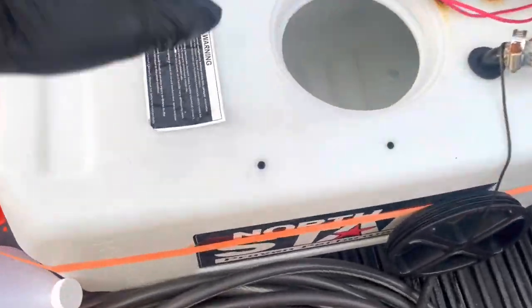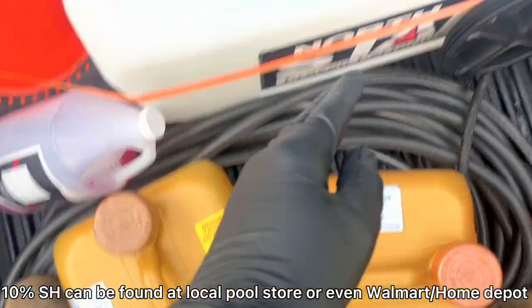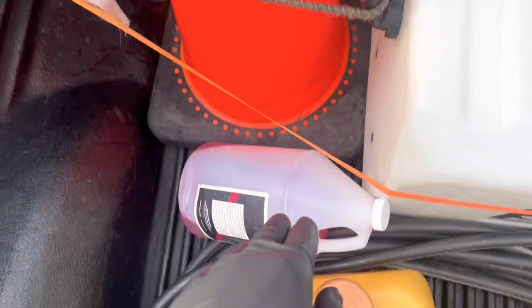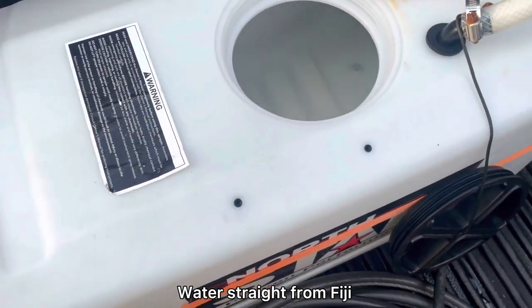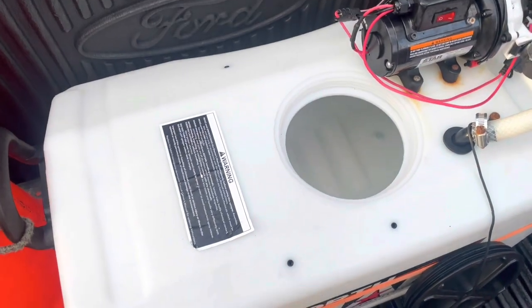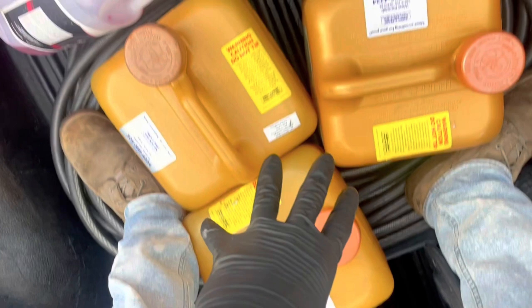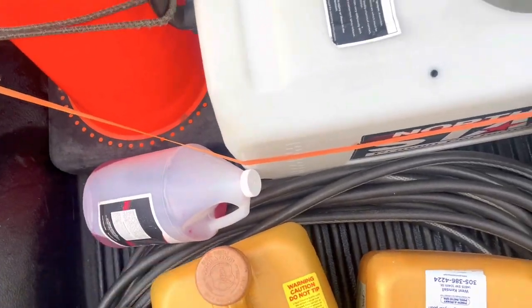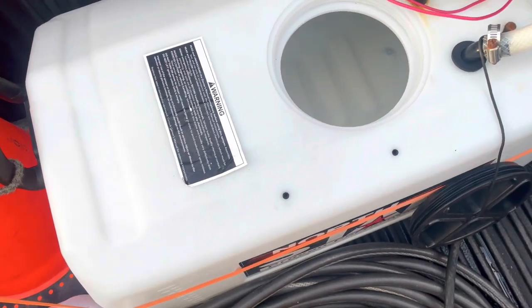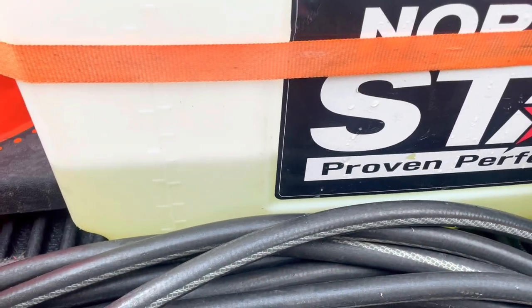This is how I do it with my one tank. I'm going to pour 4 2.5 gallons of SH into here and 16 ounces of my surfactant, then top it off with some water. That'll be more than enough to knock out the roof I'm doing today. But if I know it's not going to be enough, I'll bring a couple more of these with me and refill at the actual job site. Let's finish putting the SH in there.